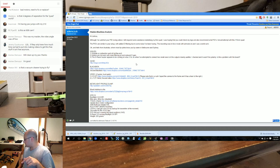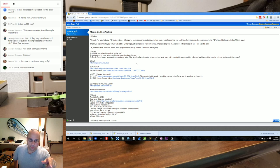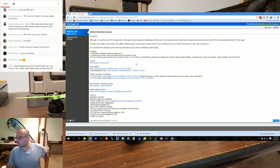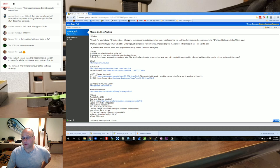So what I always do with my X-Racer is I don't use the battery pad. Well, on some of them I do. But the positive should be 5 volts for the buzzer, not 3.3. So that's not right. But you could just wire the buzzer positive to any 5-volt source you prefer. And then the negative is switched. The ground is switched. So that's a nice tip there. I've never checked it with a voltmeter, but that's how it is on every other copter flight control board I've ever seen.